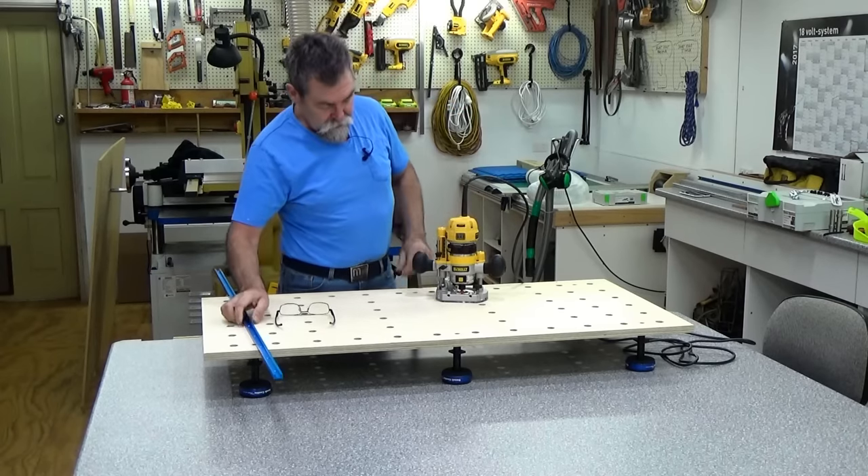It's going to go in there very well and it will flatten down. Beautiful. That's not looking too bad. This is where we're up to so far — I've got the slots cut out for the anti-slip tape, I've got the slot cut out for the T-track, I've got the inserts in for the legs. And now I'm going to sand the whole thing. I'll take this out first. I'm going to hit it with 120 to start, then 180, and then we'll do the wax.